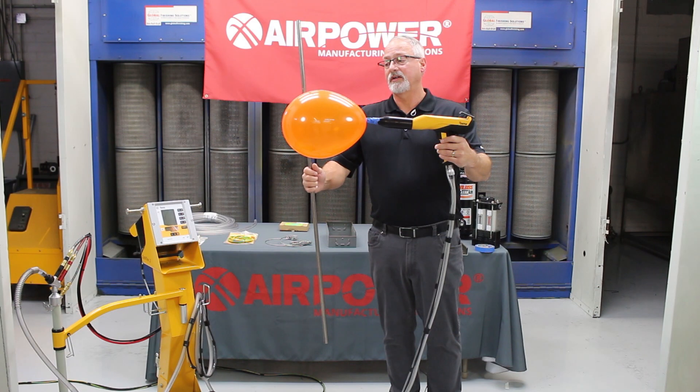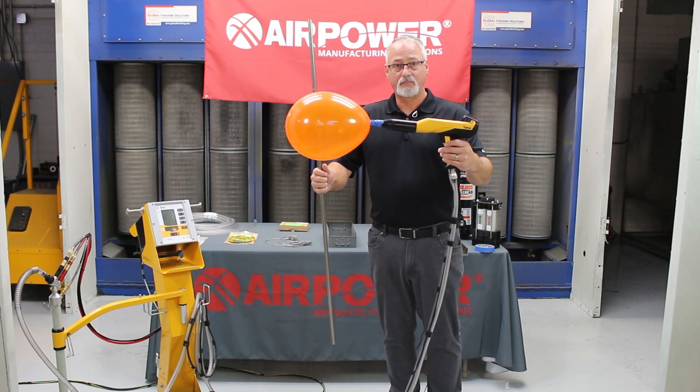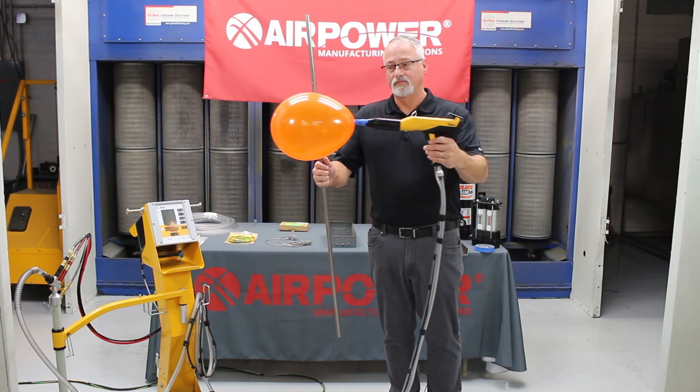Instead of being here, let's get it out towards the tail end of the corona. What's remaining to the right of the part is what's going to come back and attract to the back side of the part. So we're going to get maximum wrap when we push this part out to the edge of the corona field versus in here.